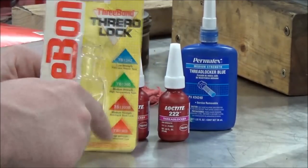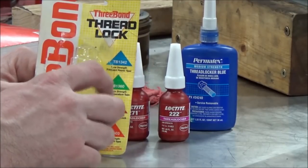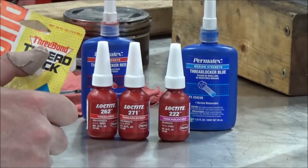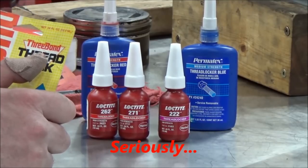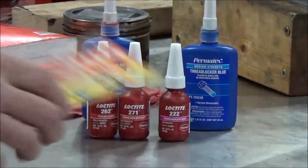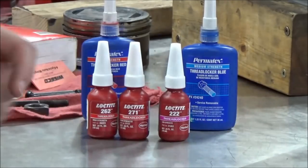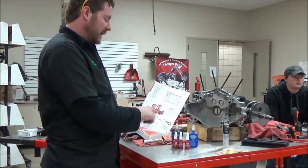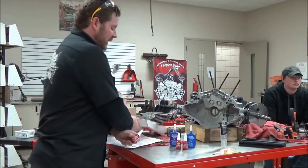We can look at this chart — blues, greens, red. Most of the time, when you think of a green Loctite, anybody who's had formal training knows green is very powerful, permanent — like it's never coming off. Well, this other company's green? If you took and used that on an application that required green Loctite, are you going to have a problem? Without an hour-long video on all these different Loctites, what I want to recommend is: you need to get familiar with your products. The service manual is telling us to use a specific Loctite, and they are not all the same.